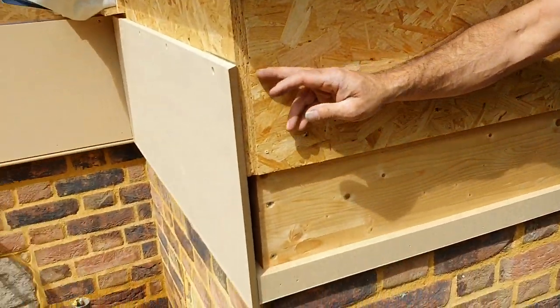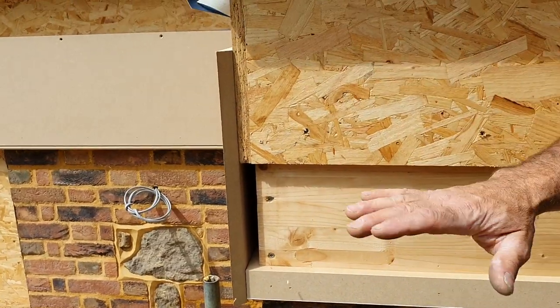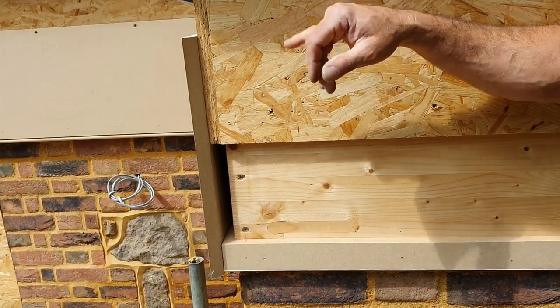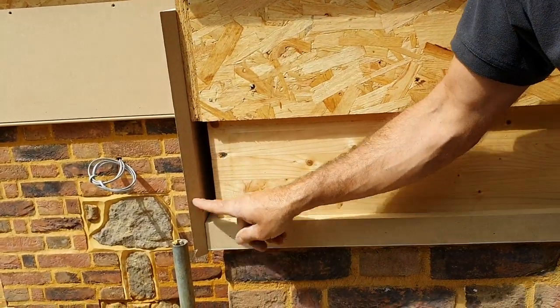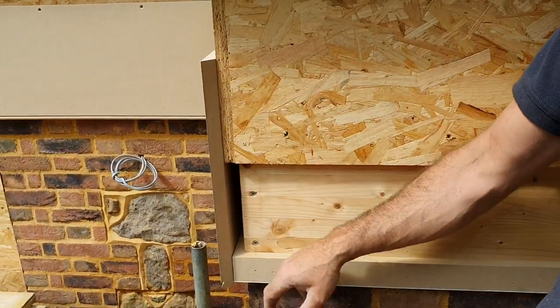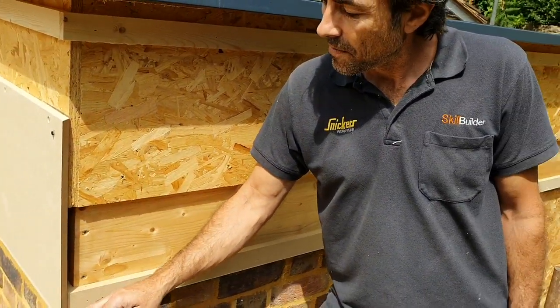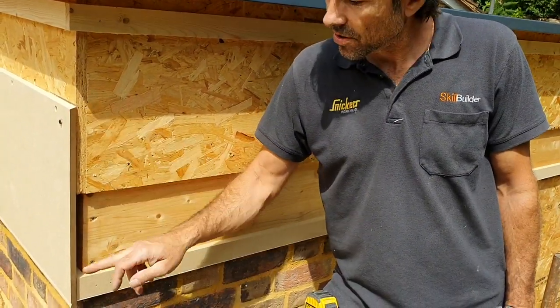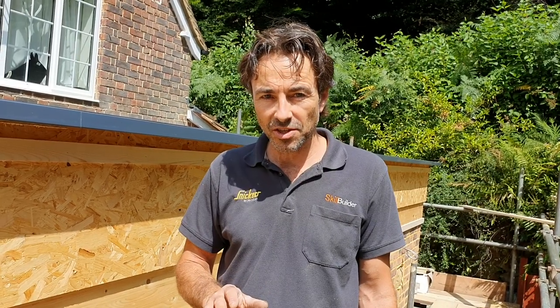There's a typical mitre there. You can see this is a glulam beam — the whole frame's glulam. We've got this OSB parapet here which runs up and contains all of the roof, and now we're running around with the first layer which is mitered. Trying to miter this material is particularly difficult — there are so many ways of doing it. All my chop saws won't reach that width — it's about 400mm. So I'm using a battery circular saw and a very simple jig, which I'll show you.